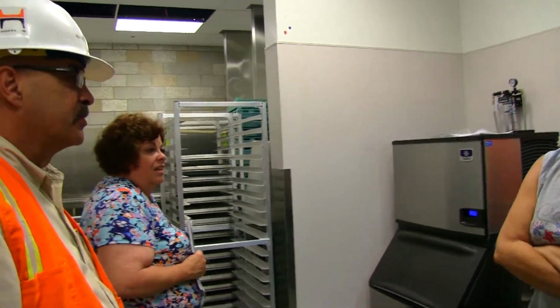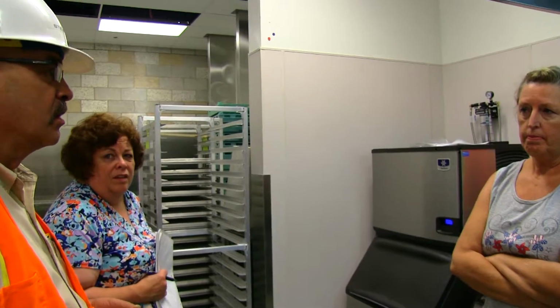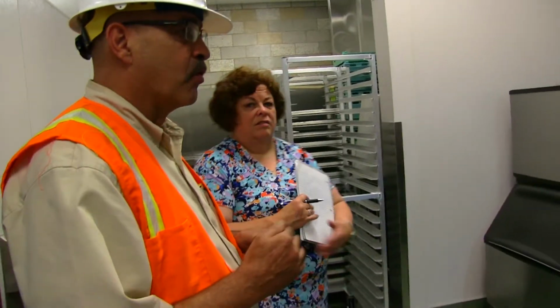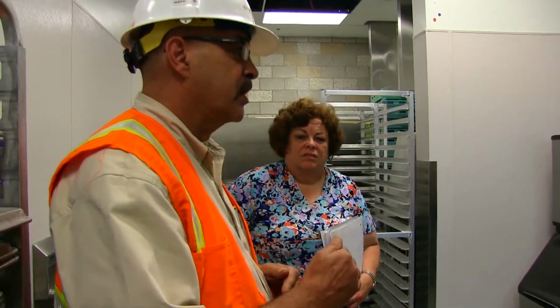The fan system will automatically start to either heat or cool the space in the morning before 6 o'clock. It has an optimal start feature. And once we get that working, the fan can start 3 hours before the scheduled occupancy.